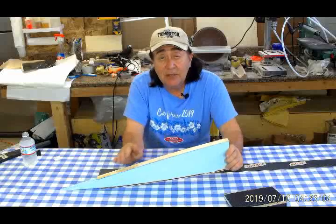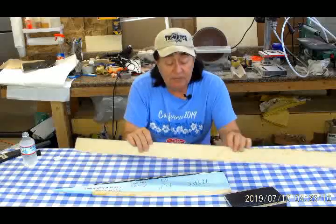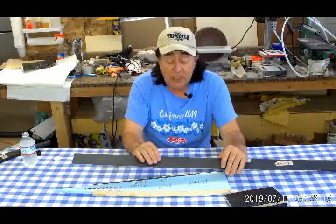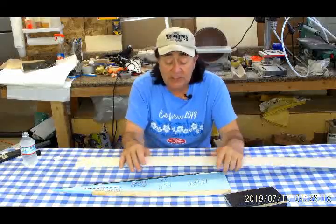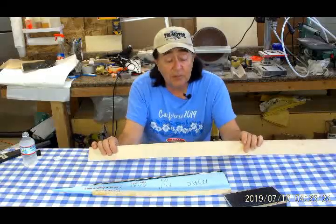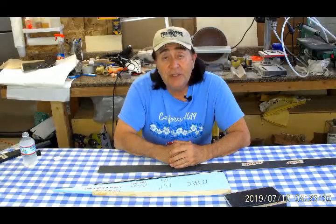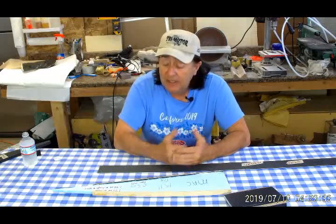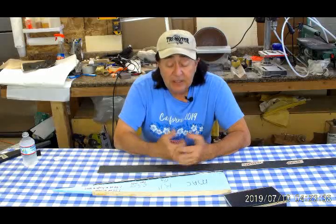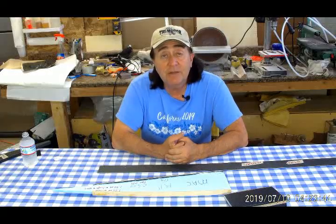We're going to have composite skins out to the end of the flap, and beyond that it's going to be fabric — and this is how I'm going to do the ribs. If you ever want to do it, this is a pretty cool way to solve the problem: unidirectional carbon fiber over some wood — could be plywood, could be balsa — then bend them onto your foam formers, and you've got yourself one heck of a strong rib. Thanks for coming and watching. I hope you make good use of this information. If you have a mind to, please click on the Patreon link in the description and help support this project. Funds are running low and I can use all the help I can get. Keep me going and in another six months or so we'll have something flying. In the meantime, please fly safe and have fun. Bye for now.